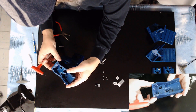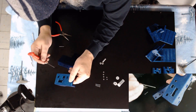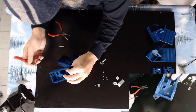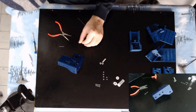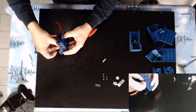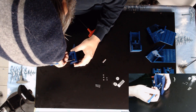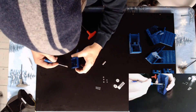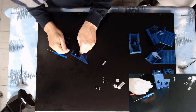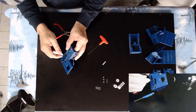Now I'm going to show you on this piece here. When I prepped these pieces, I went ahead and ran a drill bit through - you can see these two little holes right here and right here. I ran a drill bit in through the other side just to make it so I can position that nut using a T-wrench like I have in my hand, or a paper clip. You just have to get everything lined up, then push it and pull it back and forth until you get that nut right underneath the bolt. The washer kept fighting me on this one and did not want to line up in the center. I got pretty lucky on that one - I hit the nut on the first try.